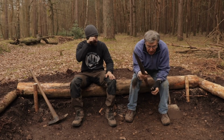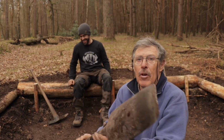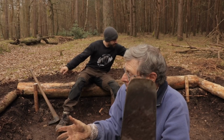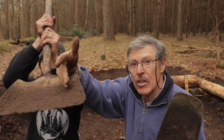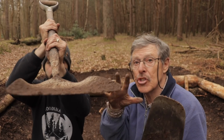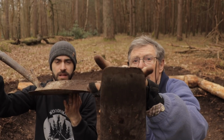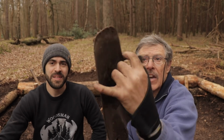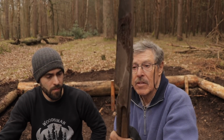Yeah, really good. The other thing that's really good, really old-fashioned, it's all old school, it's like me, I'm going to get down and not be able to get up, is what we call a drain spade. Now, an ordinary shovel is for moving volume, and the edges are curved up so it doesn't all spill off the edge. This one is flat, so you don't go down with it, you go sort of horizontal to scoop with it. It is actually a drain spade for cutting a narrow channel. Over here in the UK, the average drain used to be 4 inches, I don't know what that is in metric, 100 mil? It graduated out a little bit with a curve, and you can cut through tree roots with it. So that's very handy for breaking up the stones and the gravel as well.